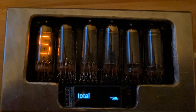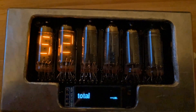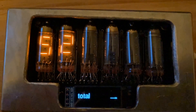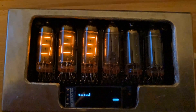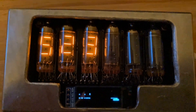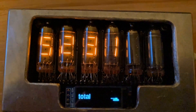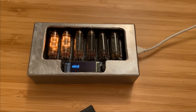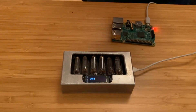The refresh rate is slow. So when you watch them turn on — I'll put that in slow motion — you can see them ramping up and ramping down as they heat up. Yes, it does look nice, to be honest, though they're not designed to look nice. They have ambiguous failure modes. For example, you wouldn't want to use these in applications where you need to quickly look at a display and get a correct value — if the bottom filament blows, a three could look like a seven. Probably the biggest disadvantage to me is that they're doubly inefficient: because they're incandescent they produce heat and use a lot more electricity than an LED. They're also inadvisable to multiplex, so all of these are turned on at the same time, unlike Nixies where I was multiplexing them — so I use far, far less power.